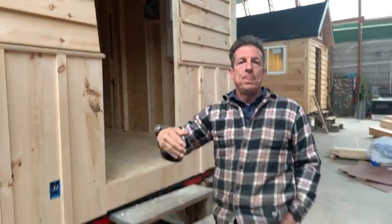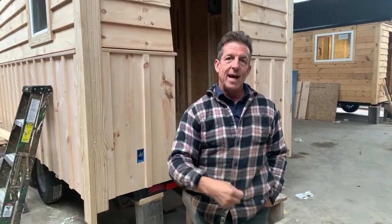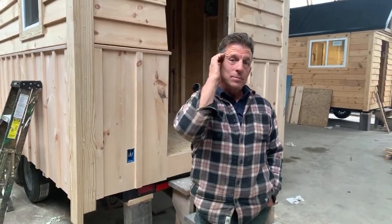Her bringing that up is another thing that we talked about with the salespeople. When we're designing your home, when you sign that contract, if you give it to us up front, that would be great. But during the design phase, after you sign your blueprints, anything you're sending us has to be exact. We need to know how big that microwave is, how big that refrigerator and stove are, is it gas or electric, all that stuff. If the customer is sending anything, you have to send those dimensions. We have to design it, because otherwise it'll be off center. And we need to know if it's a 220 or a 110. That makes a big difference. So the work is on you all: design your home, get us your information, pictures, all your stuff, and we'll price it.